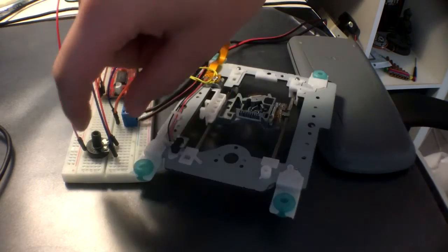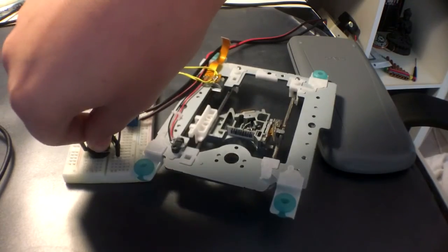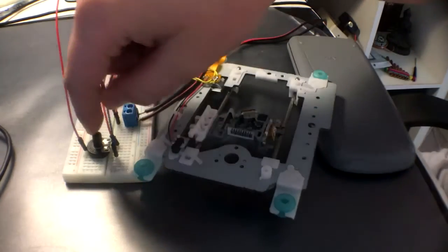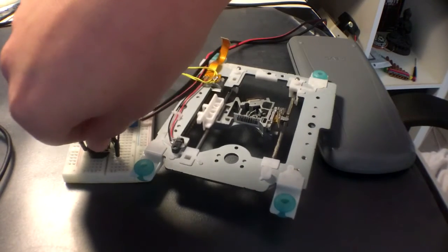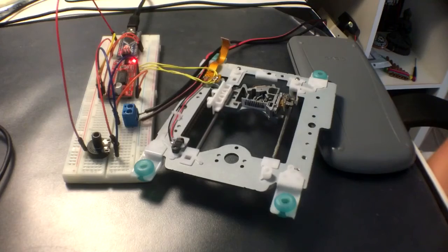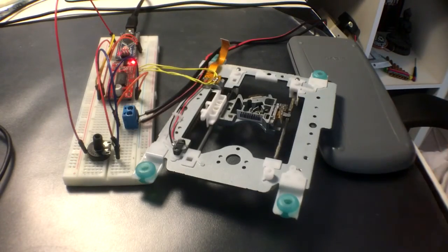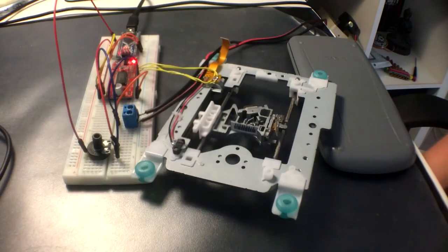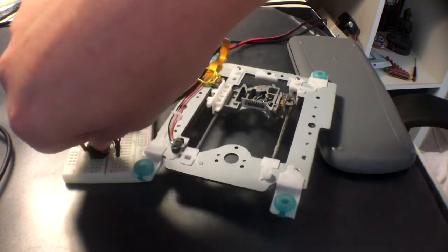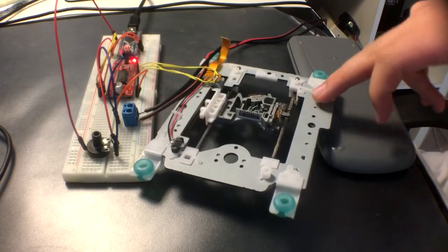What this does is it allows me to change the speed of the stepper motor by turning the potentiometer. It will read the potentiometer each time the stepper motor reaches its end. You can see it run slow, then go fast — the code is read each time the stepper motor hits this part.